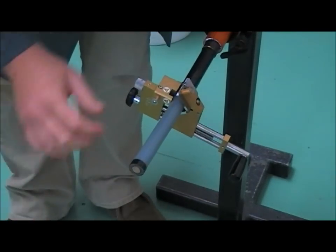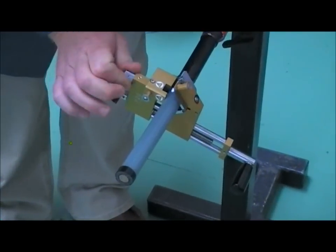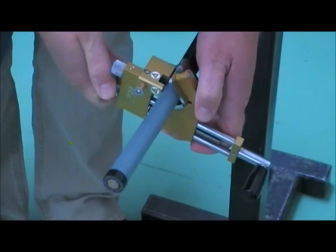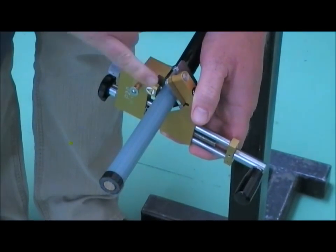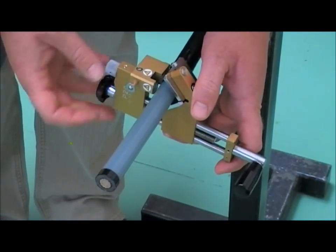Now it's very important that we wind our blade back out. And loosen our tool off. Be very careful not to drag this blade back up the insulation and put a longitudinal cut in it.